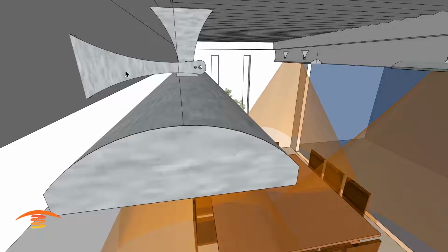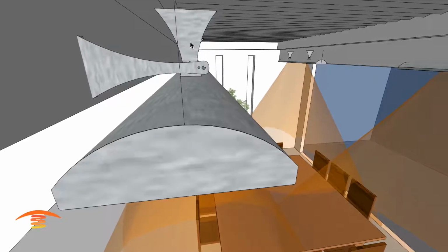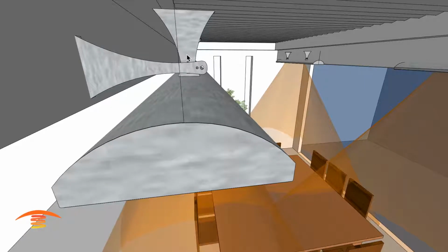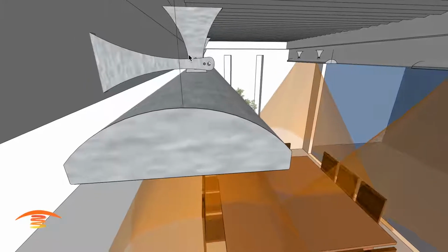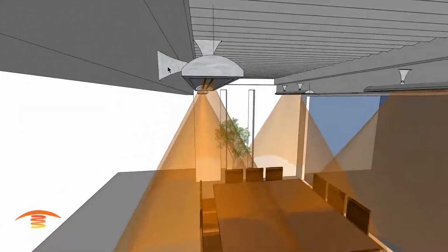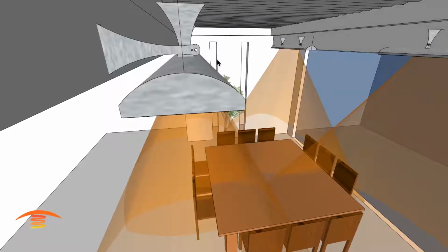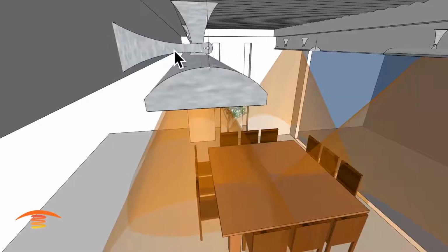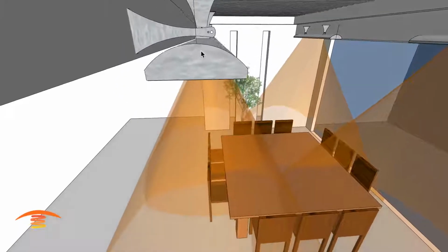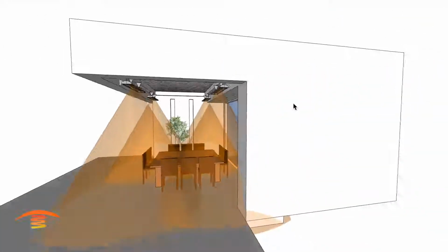I think the standard is a 6-inch, and then I think it goes in increments of 2, so it would be 8 and then 10 and 12. Yeah, sorry about that. All right, so that would be how I would mount it. Now that'll put the heater out another maybe 1.5 to 2 inches. You can go with a 10-inch bracket, but it will give you an ability to mount on a vertical surface, so that's the important thing.